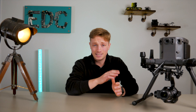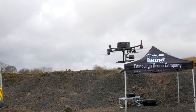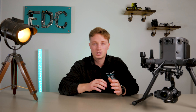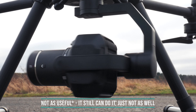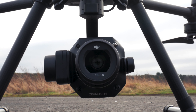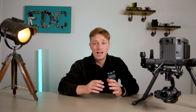The H20T is the general stock payload you normally see with the M300 — it's an all-around camera that covers all the features the Matrice offers. However, although it is able to carry out mapping missions, the quality and accuracy will be nowhere near that of the P1. This works vice versa in that the P1 would be useless for things such as power line surveying, as it's a prime lens not a zoom lens like the H20T. We have chosen the P1 because we intend to capture reality for a full building or land survey to provide reliable and accurate usable data.